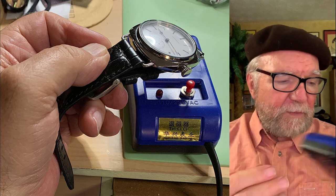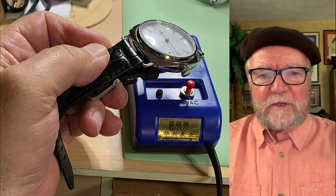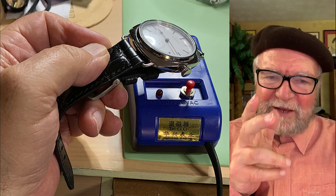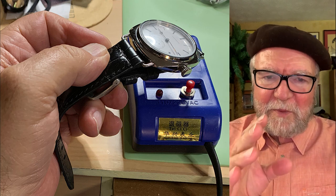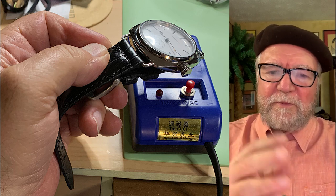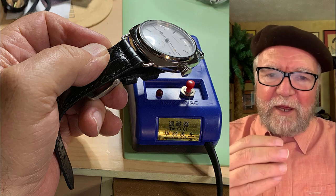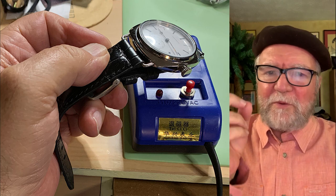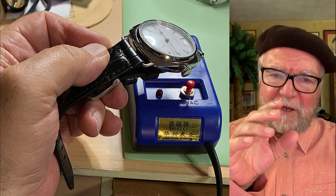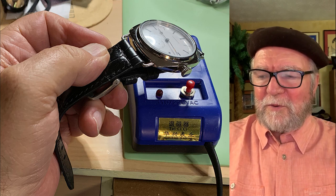At first I didn't think they worked at all. Most people think that if a watch is running slow, that can't be magnetization — but yes, it can be if it runs too slow. There was an article that talked about how a magnetized hairspring makes the watch run too fast, so people think that's the only way it can happen. But when you look at all the elements that can be magnetized around the balance wheel, you can see that it can slow things down as well.